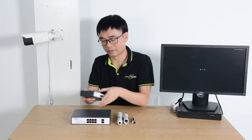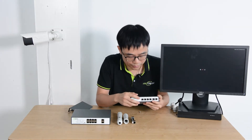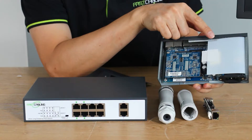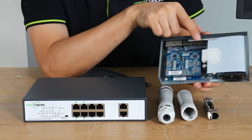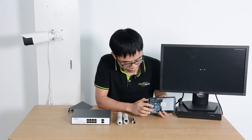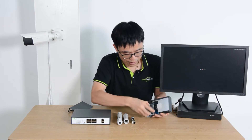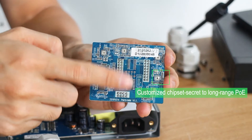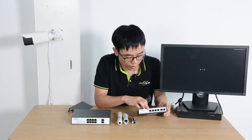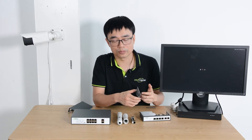Let's take off the case and look at the secret inside of the switch. This is the four-channel model — only port 1 and port 2 can supply up to 800 meter. This part is the power source; the AC power is converted to DC for the PoE. This separate board has two very important chipsets which enable long distance. You see two chipsets because they are related to port 1 and port 2. Port 3 and port 4 are just regular PoE ports which support 100 meter networks.